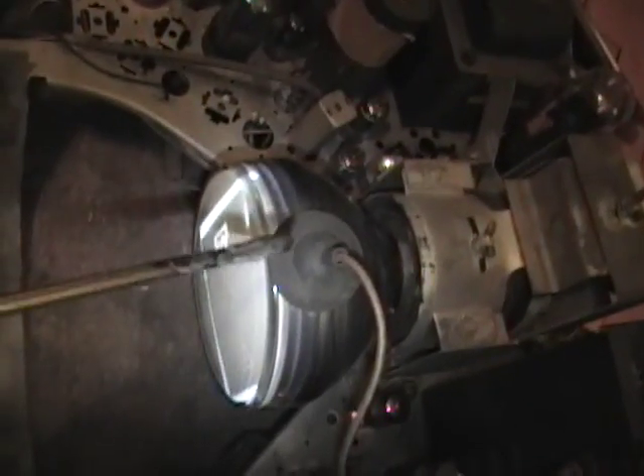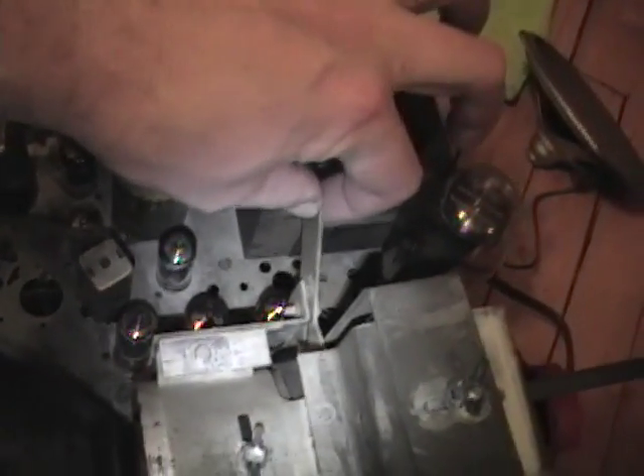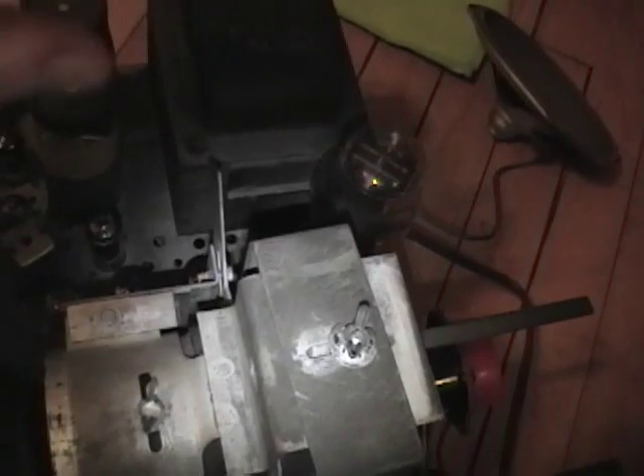After that, we've got the deflection yoke — a couple of coils of wire that deflect the picture tube left and right and up and down. Then there's a focusing magnet attached to a handle you can slide in and out to adjust the permanent magnet. Then there's a focus coil, which you control the current through to focus the picture. Then there's the centering lever, which tilts the entire assembly to center the picture on the tube. And finally, there's the actual cap with the signals running into the tube.